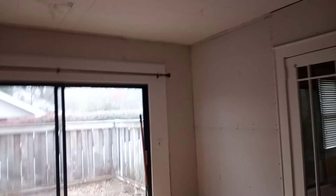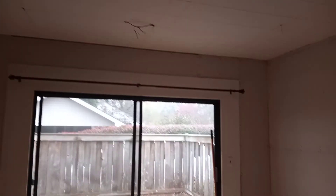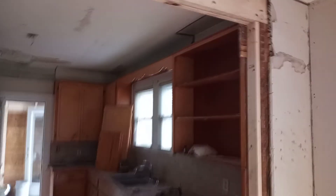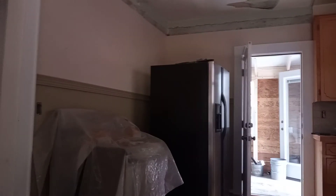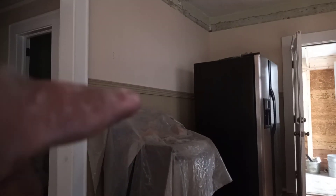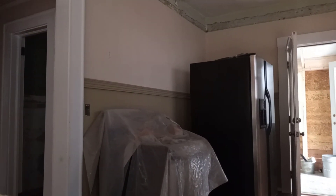Let me give you a quick walk around the house. I'm going to hang a half inch on these walls here, but I don't have my drywall here yet — delivery is delayed. Then quarter inch from that end up, quarter inch all the way around, and nothing on the ceiling here.